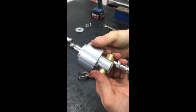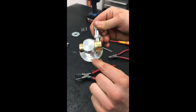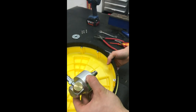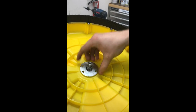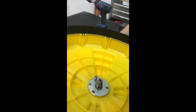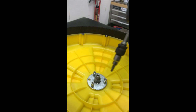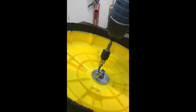Now we've rebuilt this — it turns just as it did before and still has full movement. That's the grease nipple again, so when we fill this back up with grease it will be ready to go. Reassembly is just the exact reverse of disassembly — pop it into the housing, locate the holes, pop the bolts or set screws in, and do them up. You don't need to be massively tight. Then grab the 14mm spanner again.